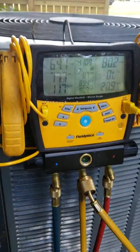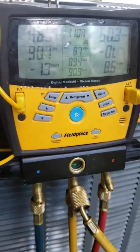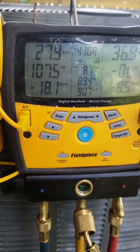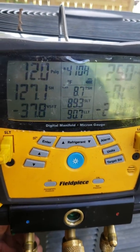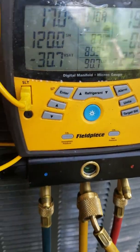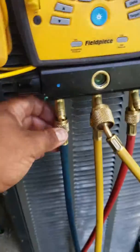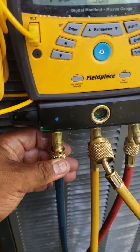Go ahead and open that up. So we're on 29 on this side and 35 on this side — that's normal. Open it up a little bit more. Close it a little to bring the pressure back up to 20. Now that we're under 20, I'm going to open up this valve here. You're going to hear it increase in pressure, so open it up quick. You're going to be able to see the refrigerant come out — right there.